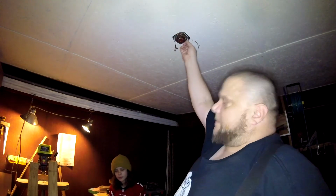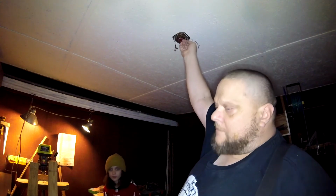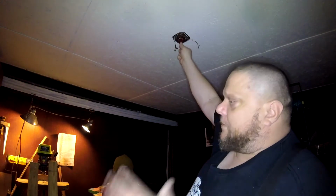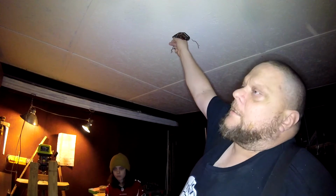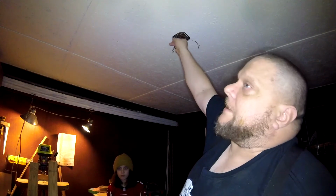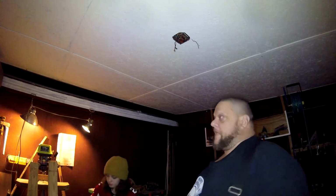Now what do we do? Yes, I have a 12 gauge wire feeding a 10 gauge wire, but the 12 gauge wire has the appropriate breaker on it, and I am only using it as a 20 amp circuit because of the smallest cable. You do have to occasionally splice cables. Just because I decided to splice it across a 12-foot room with two 6-foot pieces doesn't mean that it's not legal.